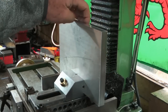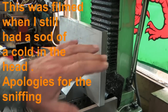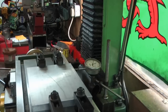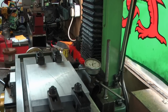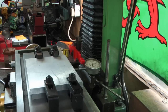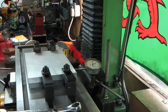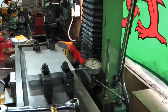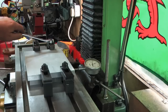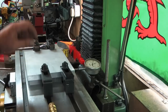So I've just got the last base of this block — haven't deburred it yet. This is the base plate. I machined the ends, the bottom, and the top. It's blocked up and way oversized compared to the drawing, but I'm happy with that. I've taken the vice off the mill bed and I'm tramming this plate in onto the bed. As you can see, pretty much nailed it — just a touch at the far end where I started, finger tight at the moment.